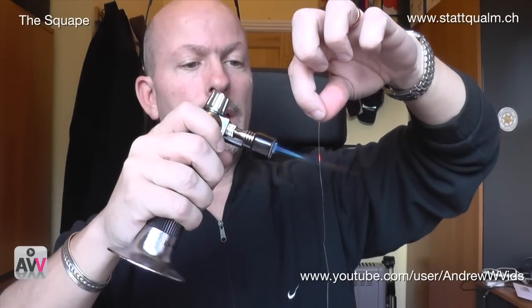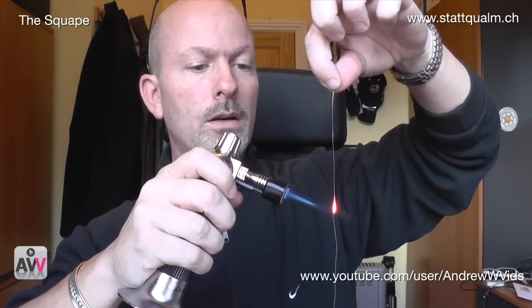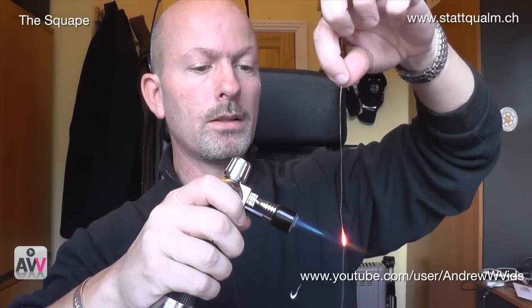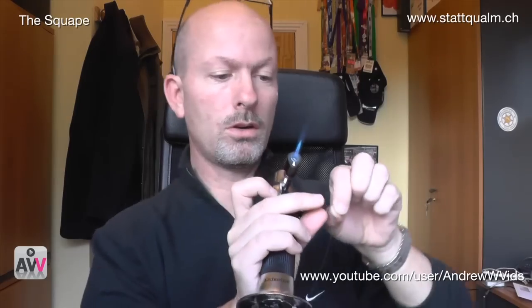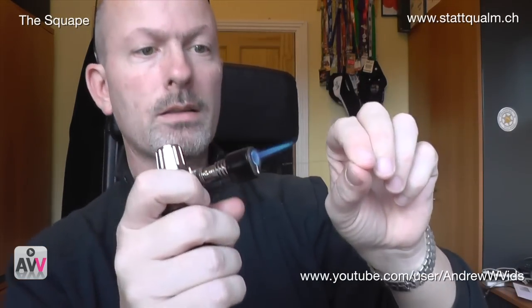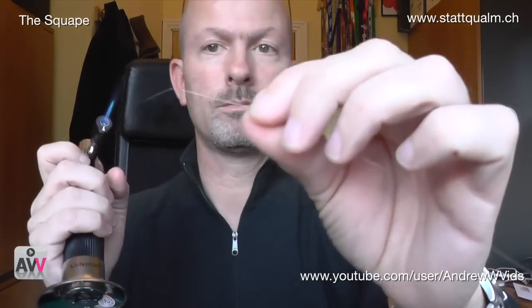And by doing it that way, it basically means that it doesn't kink over, it just keeps itself in the shape that you want to keep it. Whereas if I was to show you, I'll just do it at the end here, if I was to do a piece at the sides here, and you get it a bit too hot, look what happens. It just bends over. So, just a little tip, anyway. Hold the wire so that it's hanging down, flame it up and down that way, and that just means that your wire stays completely straight.